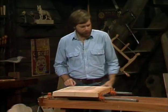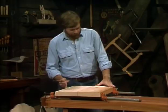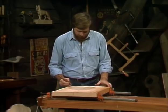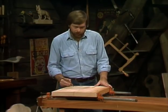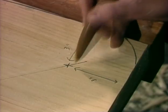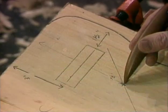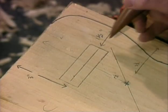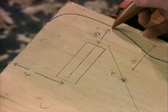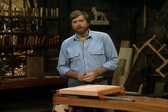For drawing out the position of the legs, I've worked from Mr. Brandly's original pattern, which I figured must be pretty good — he's been making these chairs for at least 42 years. In the Swiss area where he is from, the leg holes are positioned at three inches in from this side and three inches in from here for the front leg, then three and a half inches in from the edge and five and a half inches in for the rear leg. These other spots will be the slots where the tenon from the seat back will fit in, one and a half inches in from the edge with the center line three inches down.